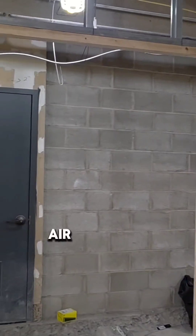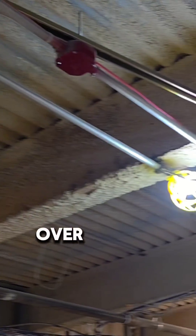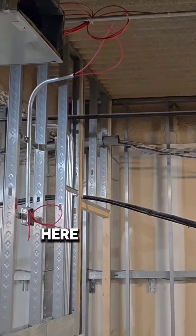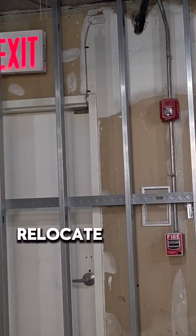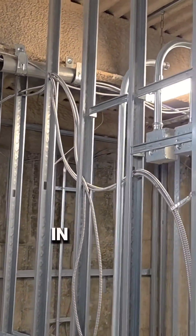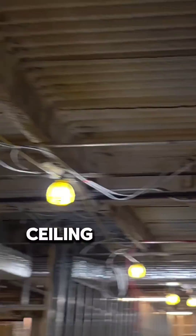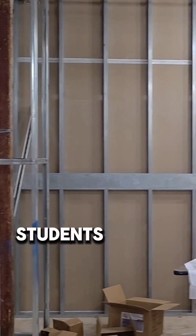All the classrooms are getting horn strobes and CO detectors. Anything over eight feet you can run fire alarm wire free air — this is all going to be drop ceiling. We've got another horn strobe here with some stubs. A lot of this piping already here is going to be coming out. New AC units going straight from the basement to the roof. Got another horn strobe here — I have to relocate this to the wall since they're going to close this all off. Another horn strobe over here inside the classroom, another horn strobe in the classroom, and CO detectors.